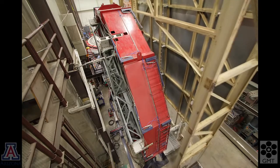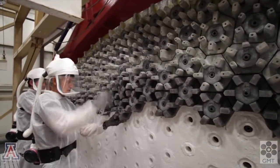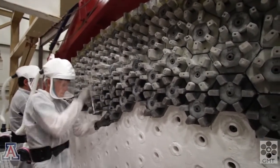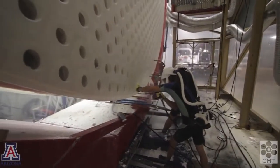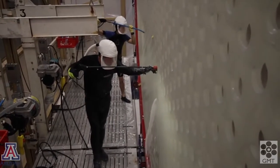We'll bring in an enclosure to protect the mirror and contain the mold materials as they're removed. The enclosure holds an elevator platform, so the technicians will have access to all of the rear surface. They first remove the silicon carbide floor of the tub. Then they'll wash the trapped ceramic fiber out of the mirror with high pressure water. This completes the casting process.